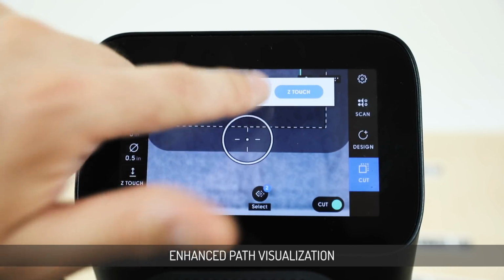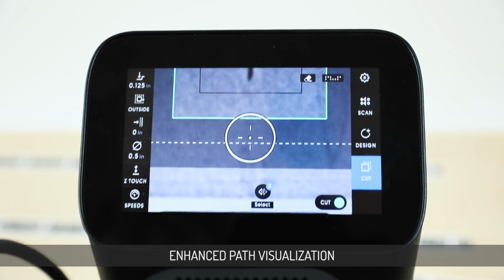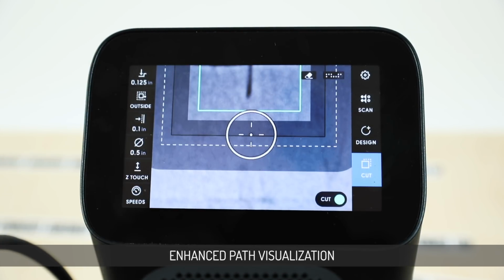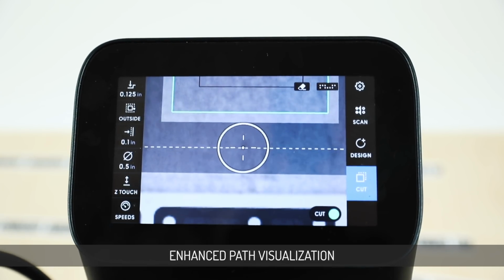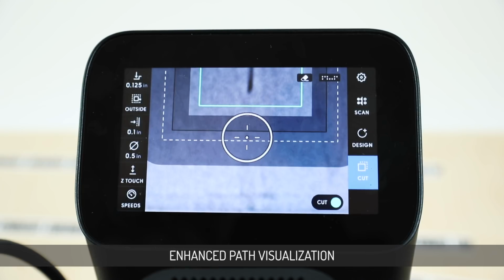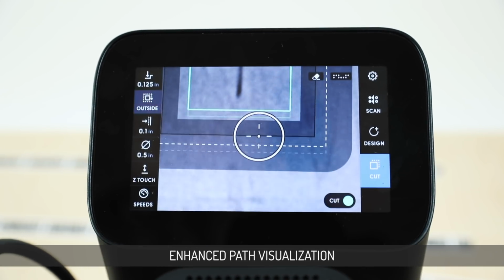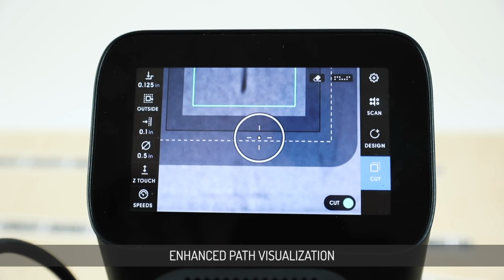You'll see in this case things get a little ambiguous when they start overlapping other shapes, and vital once you get into offsets. So with concentric shapes and offsets, things very rapidly got confusing previously. This now helps us identify the exact path that is generating the toolpath, so we can keep track of where we're at in our project and always be cutting the appropriate element.